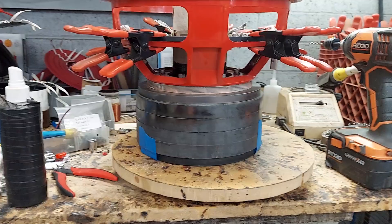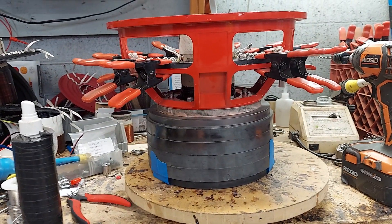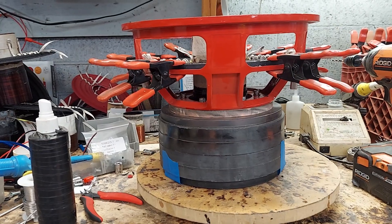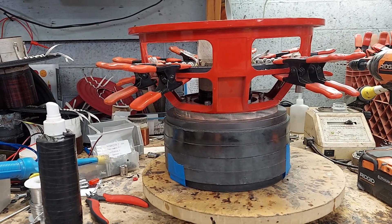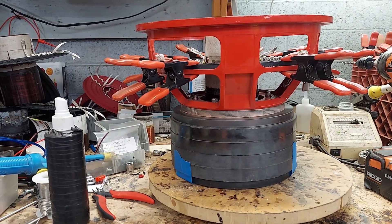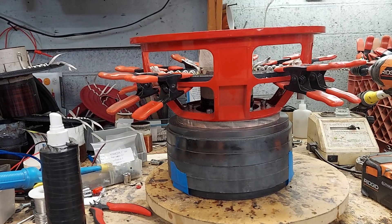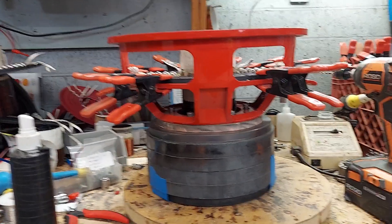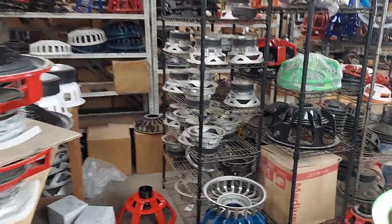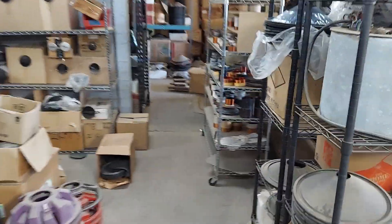Somebody had asked about LMT and LMS by TC Sounds. It was first called LMT, which is Linear Motor Technology, and then later it was called Linear Motor System, because technically you do need the proper top plate thickness in order to make it more effective. Tilo's research showed that a thinner top plate — of course it's relative depending on excursion and the sweet spot you pick. I think I have two coils left — it's the four-inch LMS Ultra.